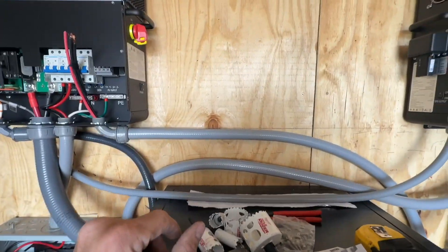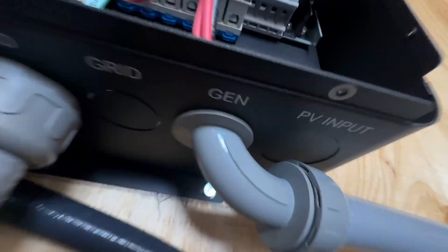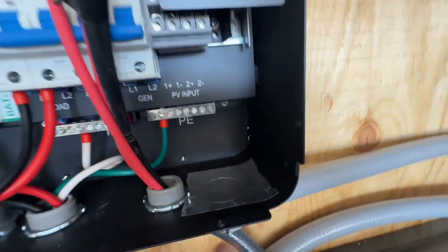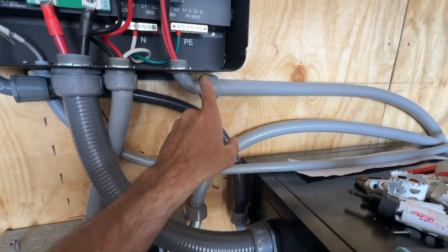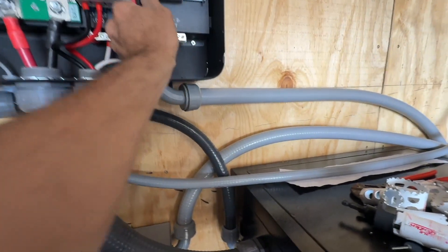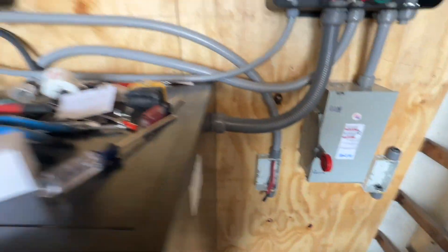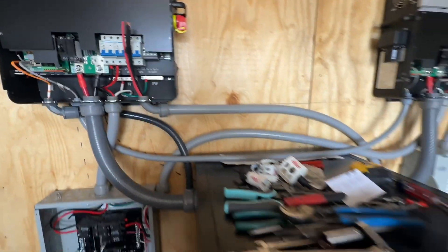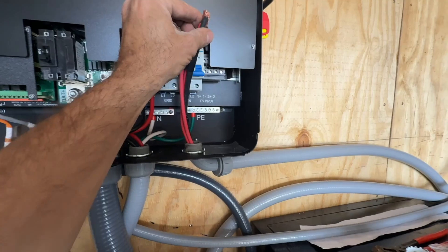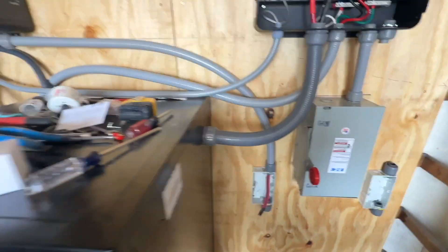So today, instead of going out of the punch hole for the PV that's here, I covered that back up with the little piece that's supposed to go there, with a little aluminum tape on this side just to hold it in place. I wanted to use an elbow because I'm going to that side, so I popped it over into the one that's for the generator input. I took the first piece of wire, measured it out before putting the conduit, had it poking out the end with a little extra, then electrical-taped it to the next piece and used that to measure out the other three pieces — so I'd have all four PV cables. Super easy.